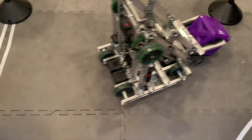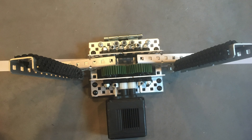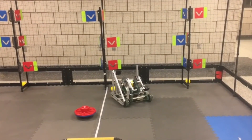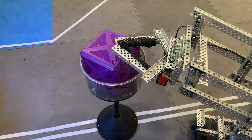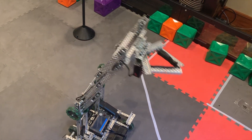Mounted to the lift is a claw. This claw is about as low profile as I can imagine, and it grips the cubes with ease, grabbing and holding them on the flat side. The claw is powered by a 100 RPM motor, which got incredibly hot. Last year on our double flywheel bot, we managed to go over temperature level 3 on the flywheel motors — same on our catapult robot with the motor on the launcher. The claw motor will consistently run over temperature level 4. At temperature level 4, rather than the reduced speed and sluggish movement of level 3, there is no movement, and you could be tricked into thinking that the motor is not even plugged in. This overheating issue may be a result of the RPM, or it may be an issue in programming, but it is usable, and we were able to make it through the whole competition without compressed air, except a bit that we borrowed from our alliance partner.